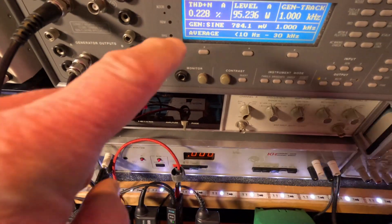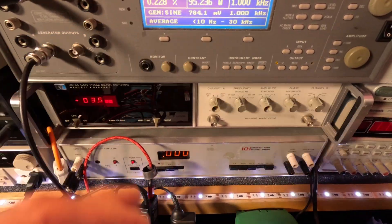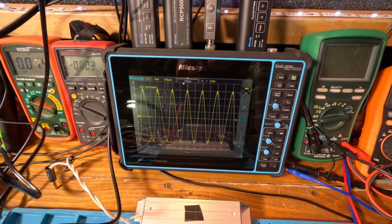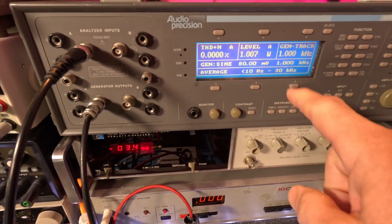82% between the power supply and the amplifier. Overall 82%, just a little bit better than that at max power. I'm calling max power — max clean power — about 190 watts. All right, so now we're at one watt input.